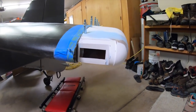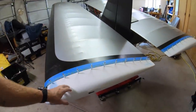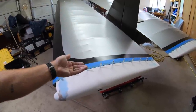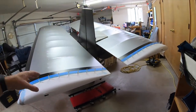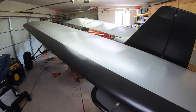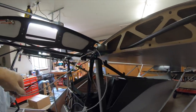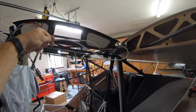We're going to have a little LED for both of those. All the holes are drilled - I need to drill them out for the size of the screw all the way through, then put the nut plates on the back and rivet those in place. The reason I'm doing those right now is I want to mount up the lights because all the wire is run, and I've got extra wire length so I don't end up being short. I'll pull it tight, cut out what I don't need, and put connectors in here so the lights can be disconnected.